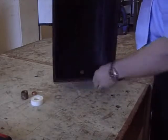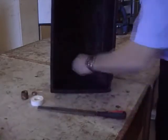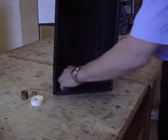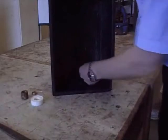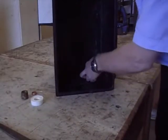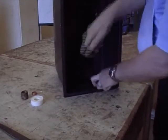So the other poly washer goes on the outside like you've just seen, and you put the back nut up. Then you need either to use the file, which you can do here, you jam it in between the two lugs and it'll hold it, or you use a pair of grips or water pump pliers. Okay, so adjust it to its smallest setting, grip it on the lugs.